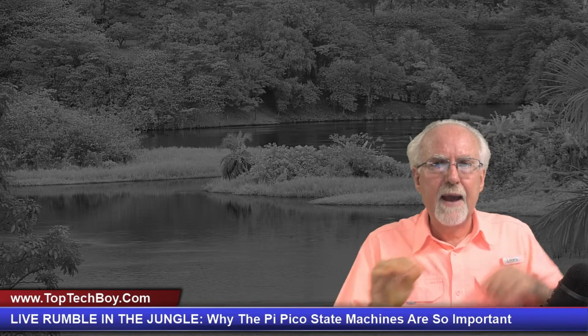Yeah, you could do a lot in the background, and that is exactly right. You are working in the background. Python can be doing all of its big and glorious stuff, and a state machine can take care of the interaction with the component that requires precise timing, or setting up something like PWM signals, things that require uninterrupted exact timing you do on the state machines.